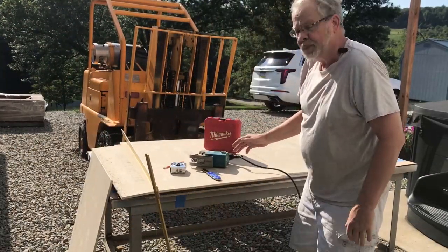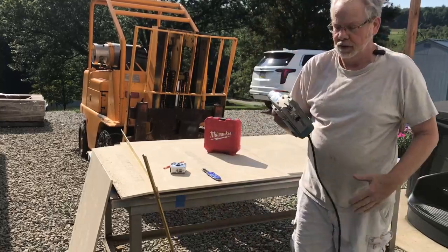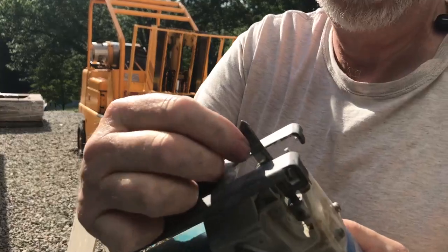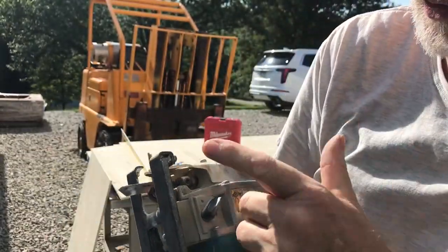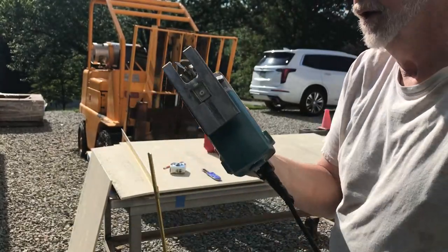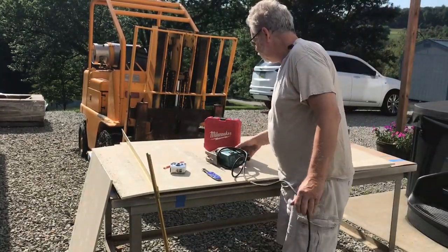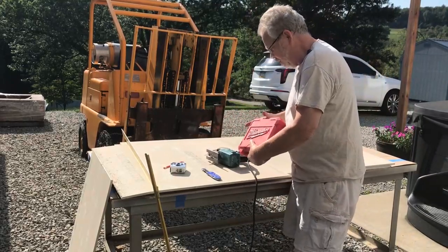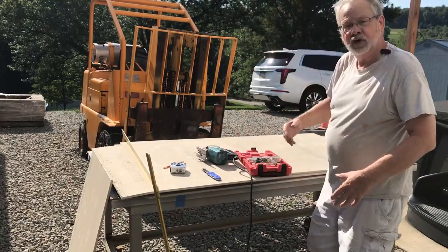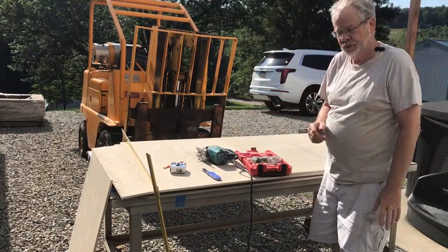For pieces six inches and under I use a jigsaw with a blade made for cutting this type of material. It's an old jigsaw so I don't have to worry about getting the concrete material up inside it. If you need to drill a hole you can use normal hole saws or spade bits — it's fairly easy to drill through.